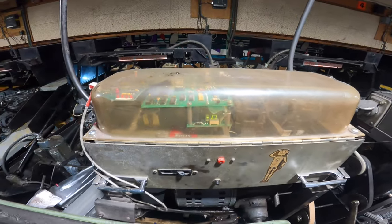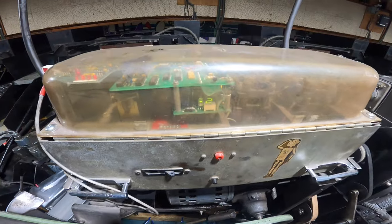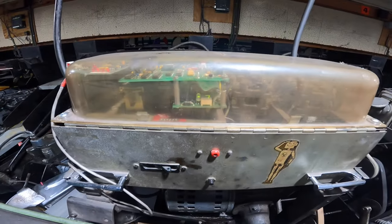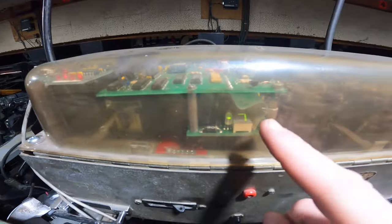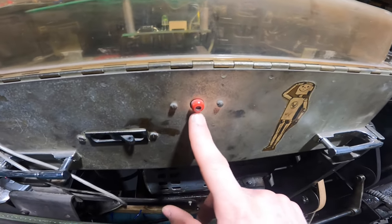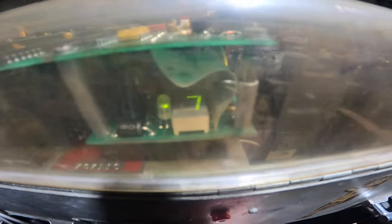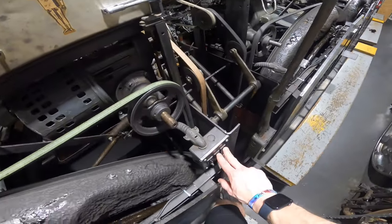A common scenario: let's say a sweep gets hit, it falls off the track, the machine shuts off, and you have to crank the sweep and put it back on the track — now it's out of sequence and not at zero. To reset it back to zero, you do not push the red button; you use this little black button below the red button. That is what you push to control your steps. If you hold it down, it will return back to zero. Before doing that, especially if you have pins in the wheel, you will want to turn your S and T switches off.